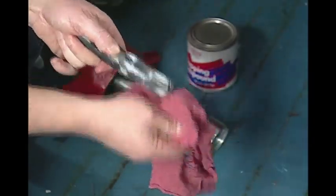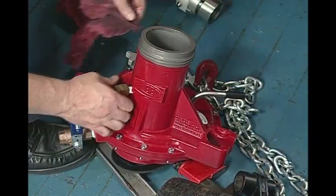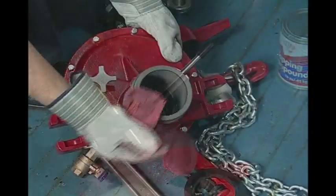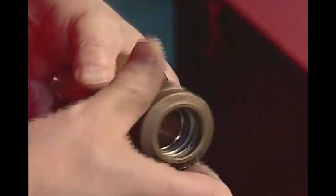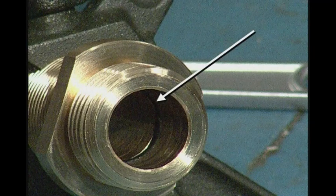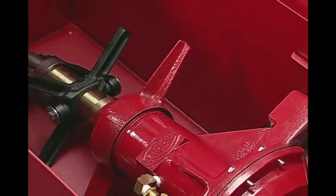After tapping is complete, clean and oil the machine surfaces. If necessary, the top and bottom chambers can be easily disassembled to clean more thoroughly. Remove and wipe down the adapter shank and insertion tool. If necessary, flush the bottom chamber with a water hose to remove any chips. Make sure not to hammer the frames to remove chips or debris. Protect threaded pieces by assembling them with their mating parts. Periodically inspect the boring bar's O-ring seals and replace them if worn. O-rings are found in the top cap and in the threaded body. Carefully place the tool back in the toolbox for storage.